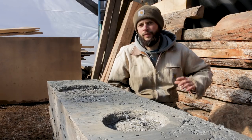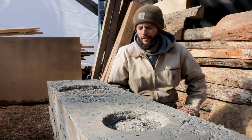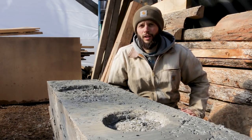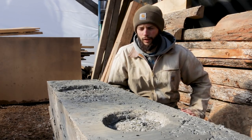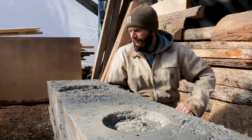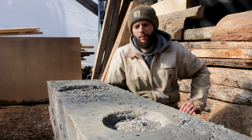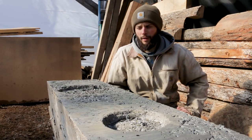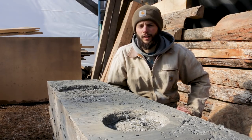Here we have the close-to-finished ballast keel casting. We flattened the top, which got rid of almost all of the dross and gave us a pretty decent surface to mate against the wood keel. We've got to fill in some pockets with molten lead — we'll do that later — and then we'll fair the entire top with fairing compound and fill in those last little divots, and it'll be ready to go against the wood keel.